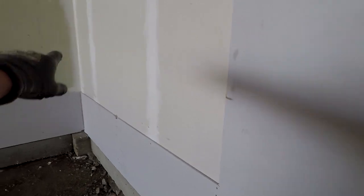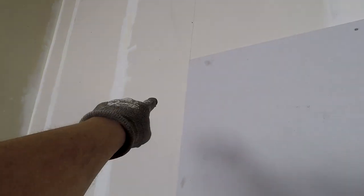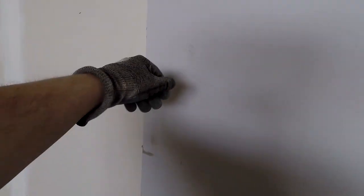As we put the sheets on, I measure both the bottom and the top, and angle-cut if I have to. I don't screw in the bevels until the sheet's in — it's double layer, there's no need since the studs are already secure. The screwing pattern is 16 inches, 32 inches, and then in the bevel, every six to eight inches when you do screw it off. Rinse and repeat all the way up. The first two rows are the hardest part — that's your layout. Now that they're on and screwed off, we move on to the third row.